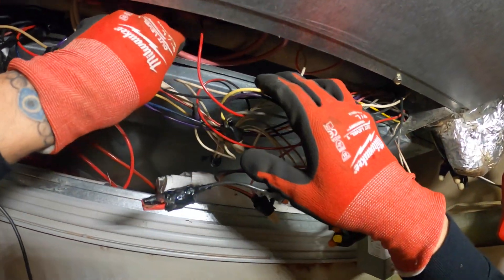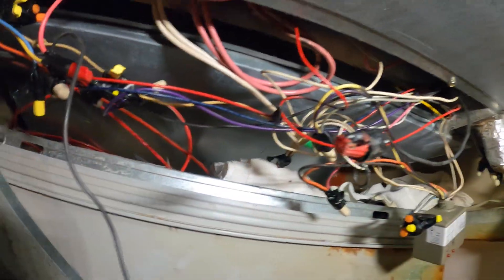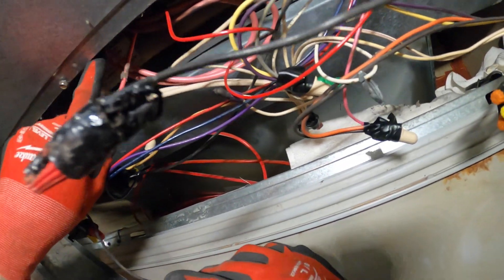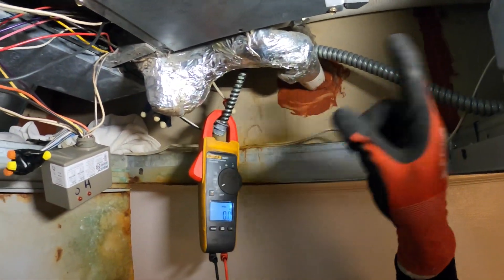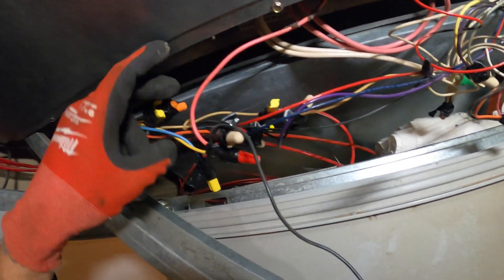We also got these pink wires — these are the heaters. Smoked. This feeds one side of the relay for the emergency electrical heat. I can't tell if they're in cooling mode with chilled water or hot water. Hopefully it's hot water because we might have a problem with this heater — we might be pulling too much amps. So that thing is just done.